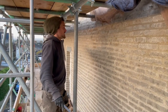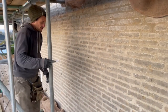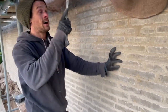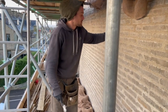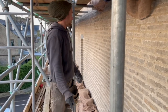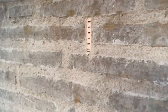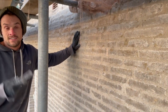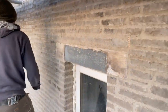We'll drop down the deck and show some work done a few days ago. On this lift it's all entirely pointed up and rigged back, so this is how the lime will look as the finished wall. Look how thin those joints are - this is five lifts of stone of this size, which is why it's taken us six weeks. We're really impressed with how it's finished - it just makes the wall come alive. You can see the perp vents we've put in are nice and discreet, and that allows extra airflow even though the lime itself is breathable.